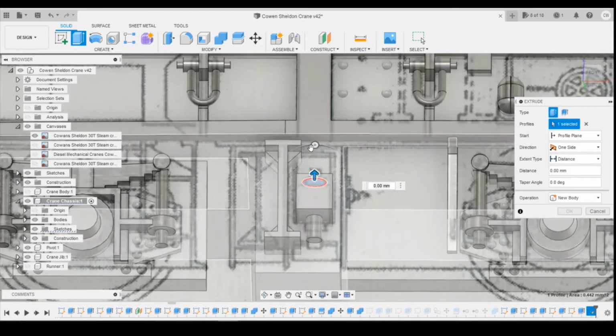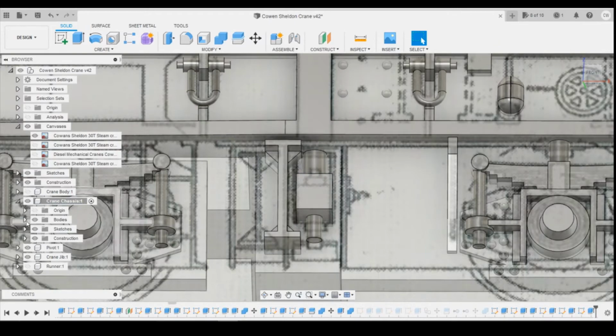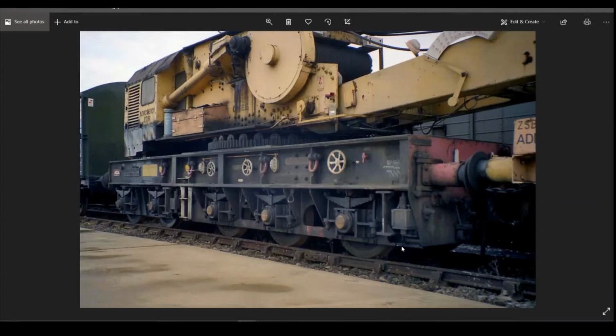So if we just rotate that and select it to the top surface there, select the joint. Okay, so body-wise, what we've got in here is this whole box that we've just drawn as a separate body. Now if we look around, is there any more detail we could draw? You could put these little tiny thin slivers on the front of this rectangle, but you're only going to bring that forward maybe 0.1 millimeters, so you're not really going to notice it.